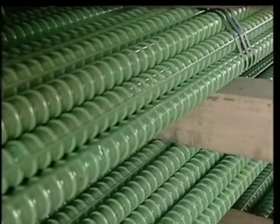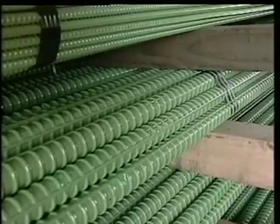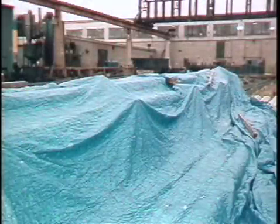If a relatively large quantity of materials has to be stored, bundles should be stacked with adequate blocking placed between the layers of bundles. And if rebar is stored in the elements outdoors for more than two months, cover the rebar with opaque plastic sheeting.